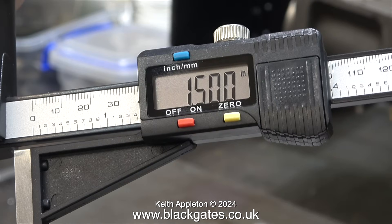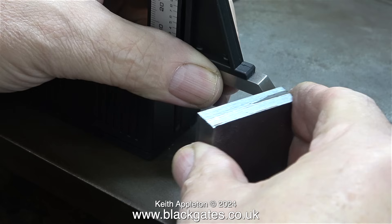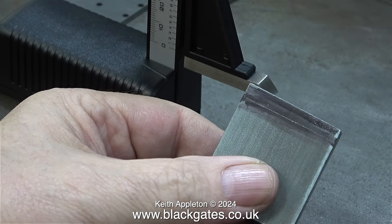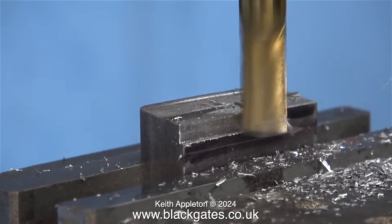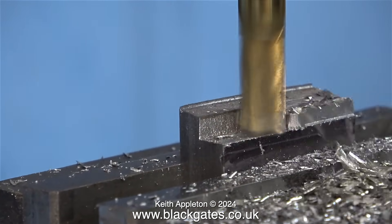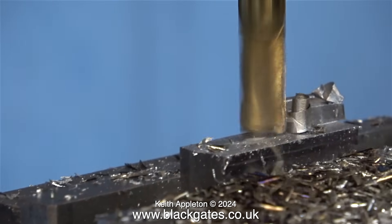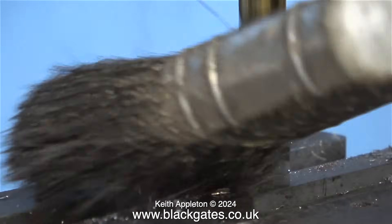This is the digital height gauge that I bought a few weeks ago. It's very cheap and very nasty, but it works — it costs £13, so I'm not complaining, nor am I being tight. I was curious to see whether a £13 digital height gauge was going to be any good, and it is sort of okay. It's not very rigid, but as long as you hold the pointer so it can't wobble about, it makes an accurate mark on the work, which is really all I want it to do. Over now to the milling machine, and I'm trimming the block to the correct size. I make tutorials for beginners and intermediates, and I'm removing quite a lot of metal here — really a little bit over the top without lubrication, but the tool did not burn out. I'm sweeping away the chippings so I can see the line, because I certainly do not want to cut below it.